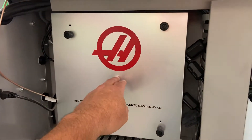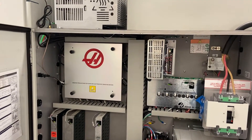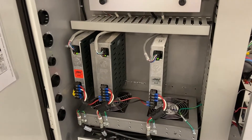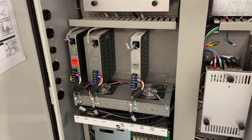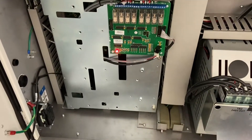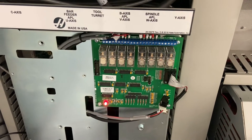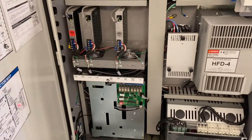In the top left corner is our main processor — this is basically the motion control and encoder feedback, everything you need right in one area. From the main processor, these are our different servo amplifiers. This particular machine has a combination of amplifiers from 30 amp all the way up to our 60 amp servo amp, and a 45 amp as well. Down here is the IO board assembly, and this particular machine has the 8M function option installed — those are the eight additional external relays, which are often used for aftermarket items available on the machine.